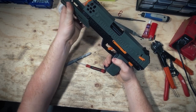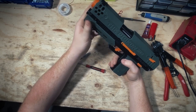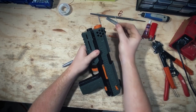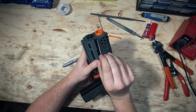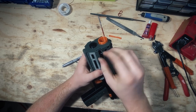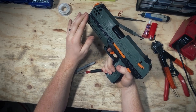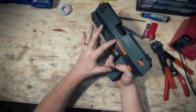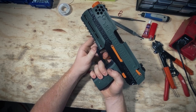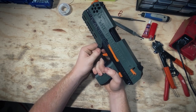If your blowback action was a little rough, a stiffer rubber band is likely to counteract that and do the blowback function nicely. Now we need to tuck the wires in the front and bring in the tack box. Put the plug in there, and this will slide on like a rail, coming all the way back. You'll know it's on correctly when you can see straight through the hole. You may need to take that tiny drill bit again and drill out this hole as well. After that, the pin should slide in easily and out the other side. With everything secure, the slide should function as intended: pull the trigger, the slide comes back; let go, the slide goes forward.